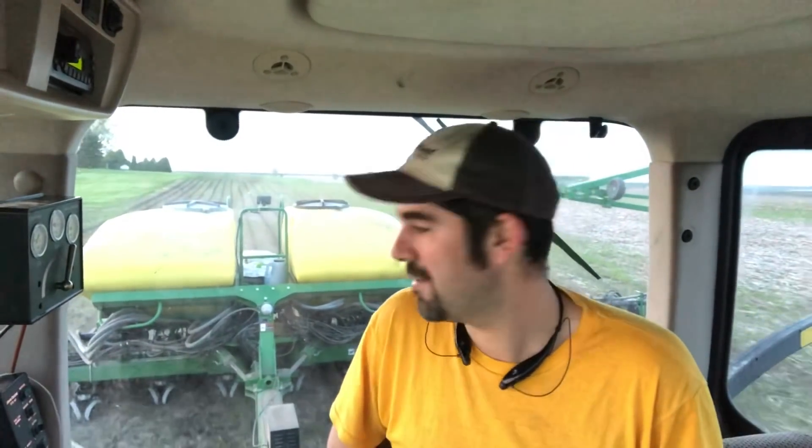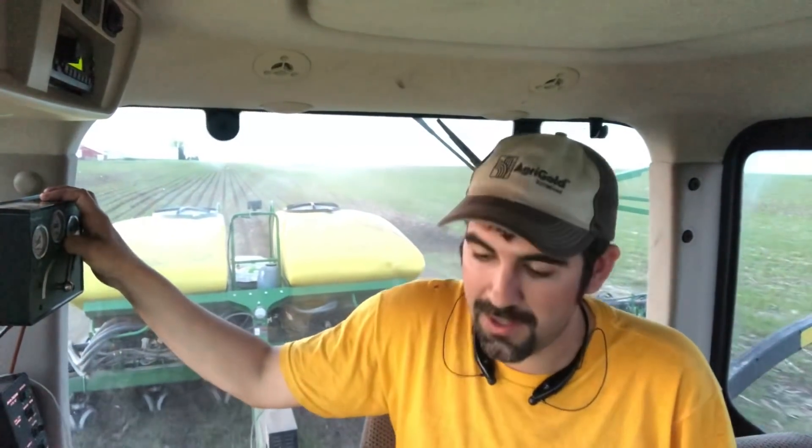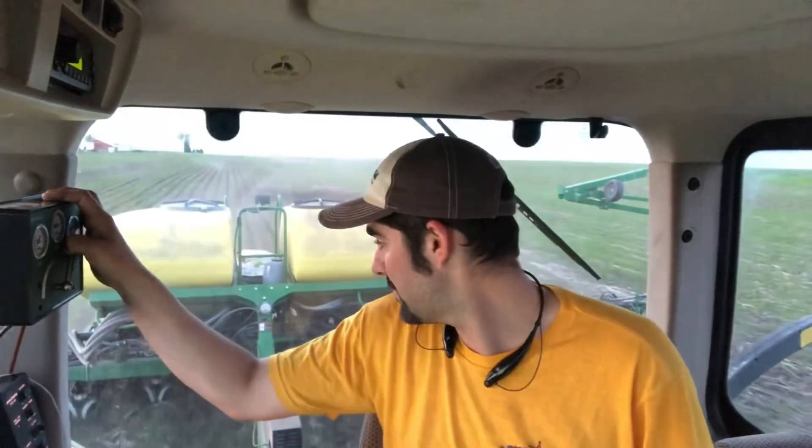It's been a good day so far. I'm over here on an 80 that is actually bean stubble with cover crops seeded onto it. The cover crop is coming pretty good in spots, a little thin in other spots. We've had a bad spring to get things going like that. But we're no-tilling corn right into it and it's working really nicely. I'm running a little more down pressure on the row cleaners, and the reading on the Smart Firmer for the clean furrow category is running really high, so we're doing a good job here. There's not any residue making it into the furrow. We're going to keep rocking along and see how much we can get done before the weather changes.